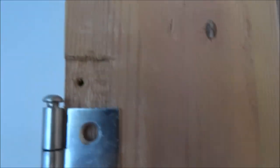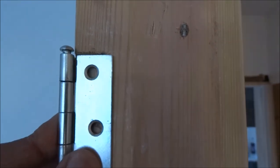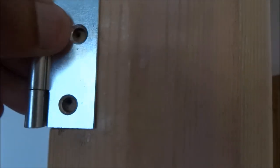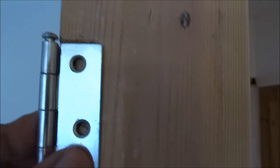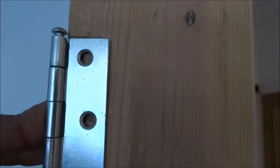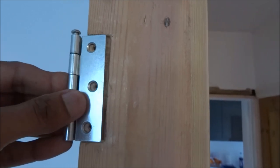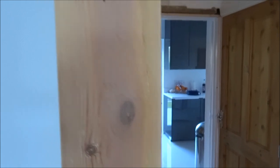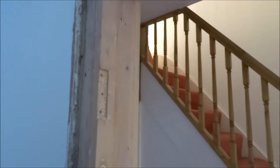Just to show you the difference — the door would have been sticking out slightly. So I'll just refit these hinges correctly now, and I'll just pack the existing holes full of wood or little sticks. Hopefully that will help. So let me start refitting this and get the door back on there and put a new door stopper on.